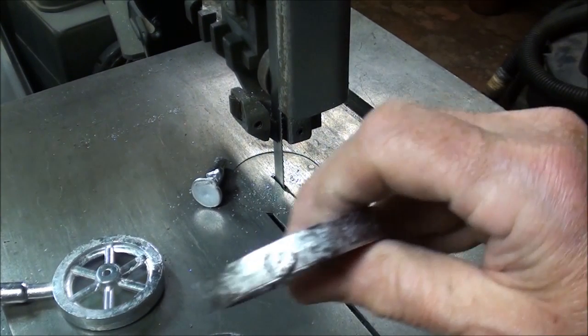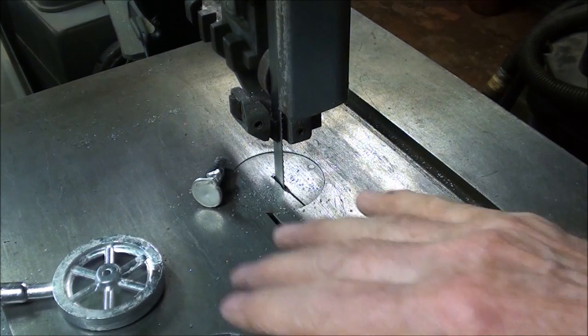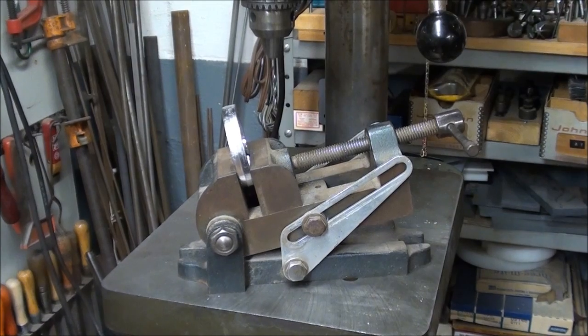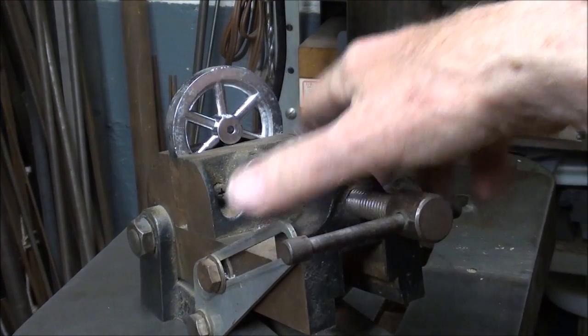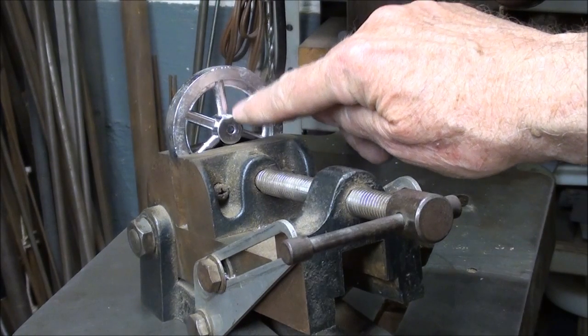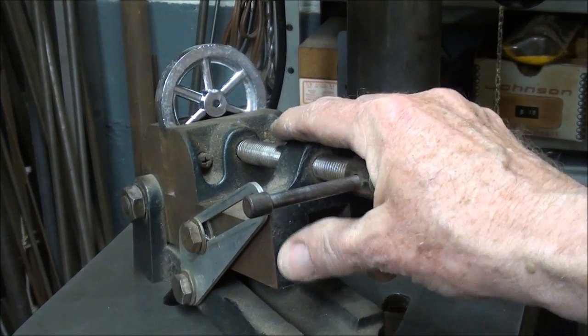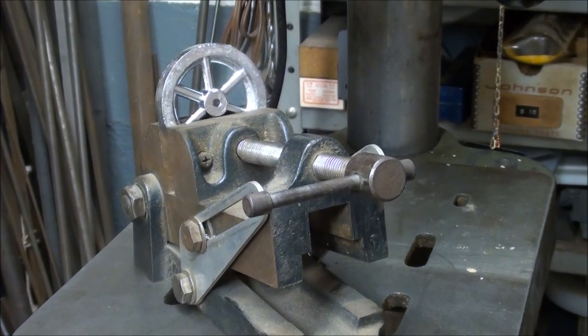Well, as easy as that was on the bench vise for the hand hacksaw, it was easier this way. I think I'll finish off the batch this way. I'm going to drill the set screw hole now. This little Palmgren tilt device is set at 10 degrees, and I've center-punched the hole on that little flat spot — that shrinkage spot — and that's the number 38 drill, which is the tap drill size for 5-40. Remember, number 5 is an eighth of an inch, a size that I favor, but it's about extinct, I think. I'll drill that off camera.